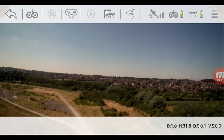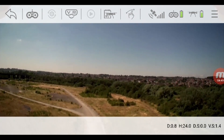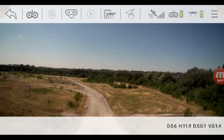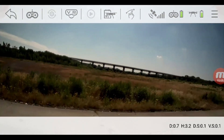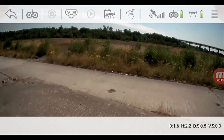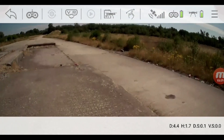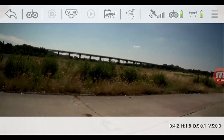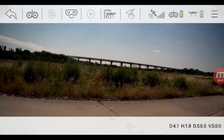I'll do another test to see how far over 200 meters I can push it. I still had a good line of sight with it — it's a really good quadcopter. The return-to-home is absolutely fantastic: if you go out of range it automatically returns home to where it picks the signal up again, and if you activate return-to-home manually it comes flying back really quickly. In the geo settings you can set the return-to-home altitude — 20 meters, 30 meters, as high as you want. The default is about 25 meters, which is great — even my Bebop doesn't let you set that. The GPS is as good as the Bebop, no problem at all.